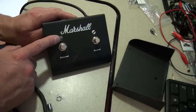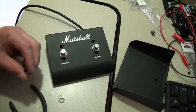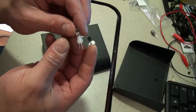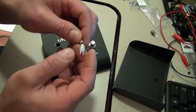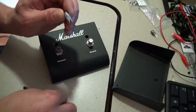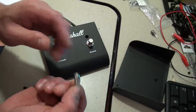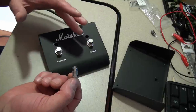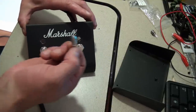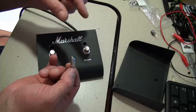I ended up drilling a pilot hole where I made my marks, then used a 5/16-inch drill bit. These bezels are probably metric in size, but 5/16 seems to fit okay. They come with little plastic cups that help keep the diode leads separate, and that sits in the hole with a little tension. They also came with a lock washer and a nut. These are 99 cents for five - pretty inexpensive. I need to determine which color LED is which, get them mounted, then hook them up and check the brightness of the two LEDs.